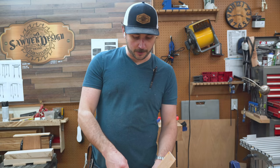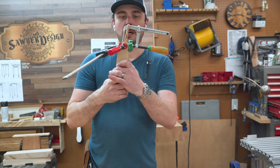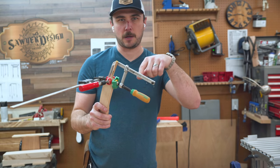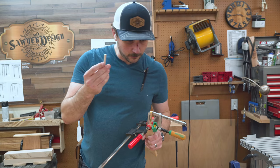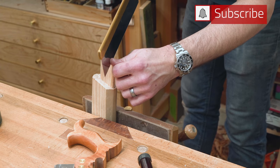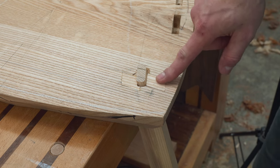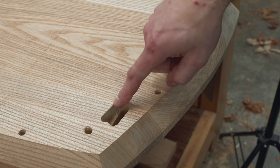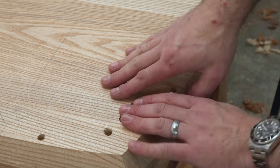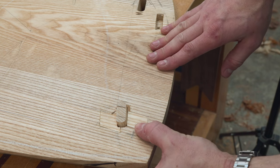I learned something — I'll share it with you. In doing these bent laminations for the slats, trying to twist them out of their hole, they wanted to delaminate. Even though they're put together with epoxy, something about the twisting — there's just not a lot of surface area, probably a lot of short grain there. This one broke clean off. So I just put in a little maple dowel and I'll glue it in place. In moving from rectilinear forms, I've really enjoyed how by hand, by eye, and free-flowing all of this chair making is. One mistake I want to point out — I forgot to tilt the table up. I got one angle right but I didn't get the second compounding angle. For a personal educational project, I think I'm all right with it on this one — maybe not something I'd deliver. Let me know in the comments if you would leave that and take inventory at the end, or if you would stop there and remake that seat.